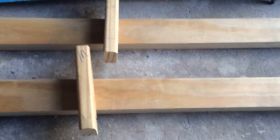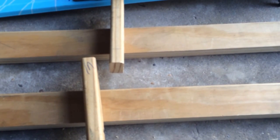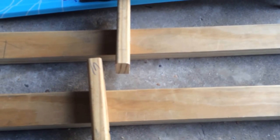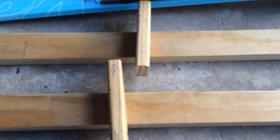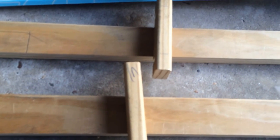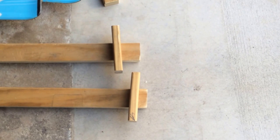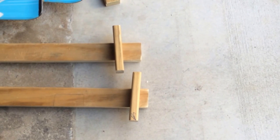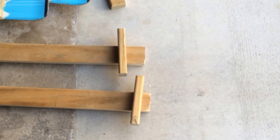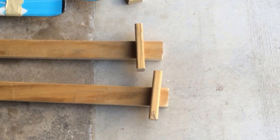As you can see, it was a good idea that I secured the cleat on the rail and screwed on the decking board. As you can see, they're not 90 degrees. So I'm going to cut the excess and leave an inch off so it could rest on the rail, not on these little pieces. These little pieces are mainly for the purpose of preventing it from moving — they don't do a lot of heavy lifting.